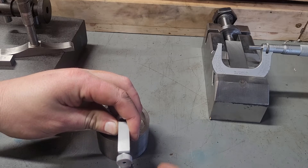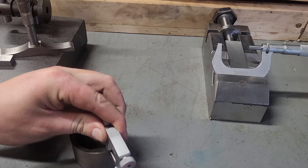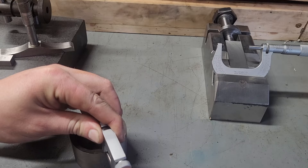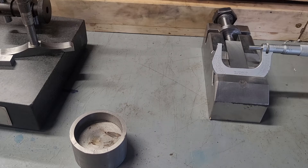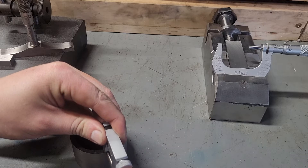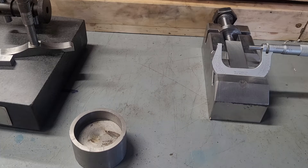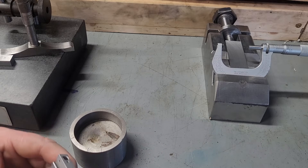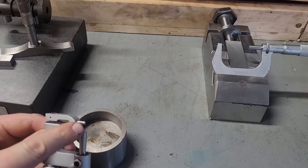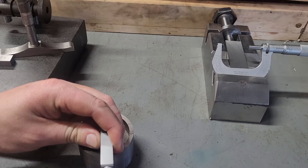We're going to repeat that in the same location in case I misread it. What we're showing here is a lack of repeatability due to dirt. We have a lot of dirt. Right now we're reading 75 plus 13, so 88. I'm going to repeat that one more time — 75 plus 13.5, okay, half a thousandth. These are really sensitive to how you hold them on the part, because right now I have a rod in here. We're going to show you the interchangeable part in a moment. But this is pretty fast to just measure a wall thickness.